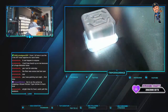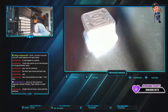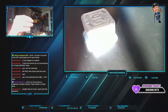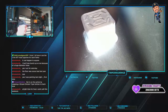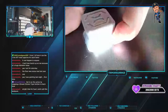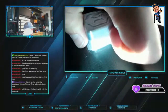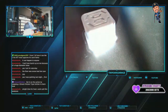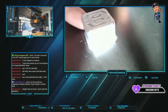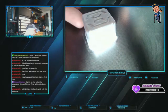I mean, you always do that. Oh, okay. Yeah. You can always do the good old break the spatula. Yeah, it was not a part of the printer. It was the top of the spatula here. Lovely. All right, we're not going to break it. I'll show it after on Twitter. But we're going to let it release. I don't want to ruin a pristine glass bed. Fresh and clean. So we know it sticks, but also it has a little bit of elephant's foot because the Z was a little bit too close to the bed, but didn't scratch it. It was just a little bit too much. It almost feels like glue on there. It does, yeah.